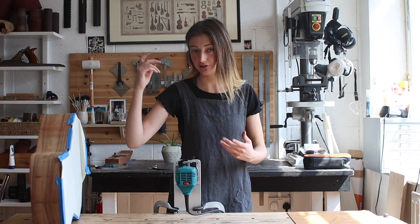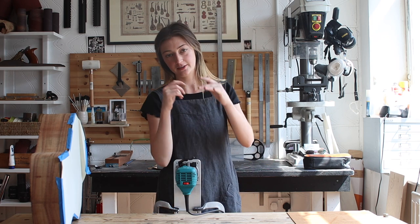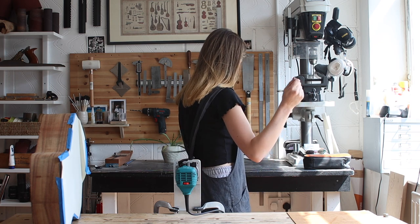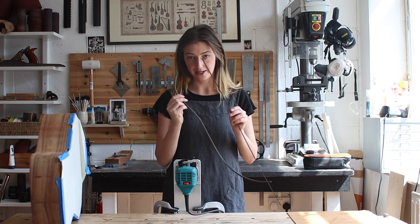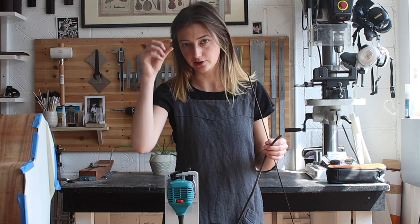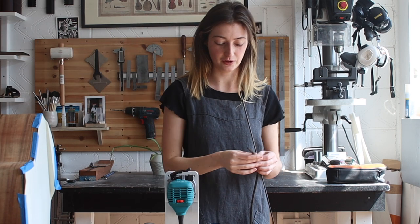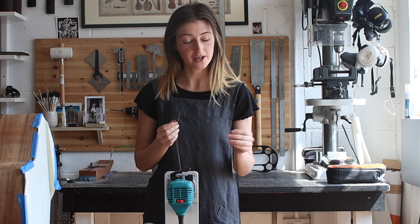Our first step is to check the calibration of the zero bar, because when we are setting the depth of our cut, we need to make sure we are using our actual bindings and actual purflings. It's quite hard to do that with a cradle because you're just constantly there with a little measuring stick, trying so hard, winding down and winding up and doing test cuts. So with this jig we know it's going to be dead on the correct thickness, which is quite nice.